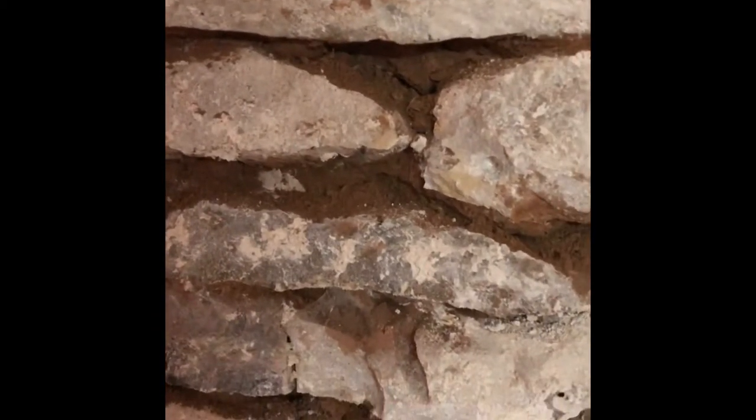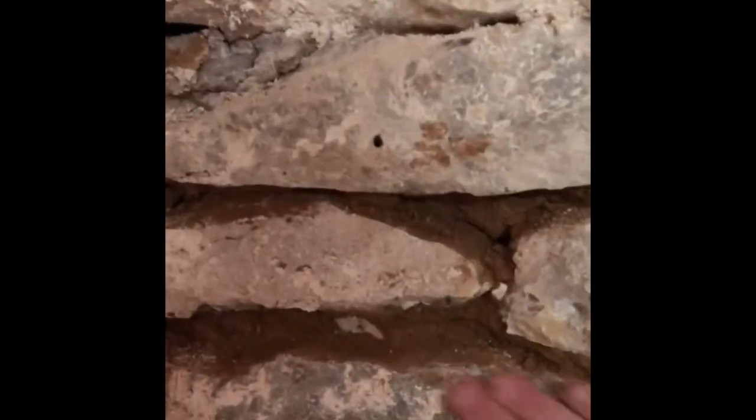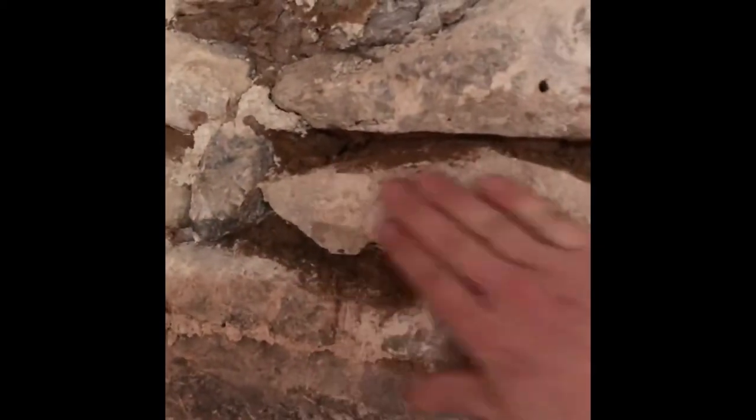That's the first step — get in there as deep as you can and get all the rubbish out. Then all you do is get a soft brush and brush off all the surface dirt, which will be mixed with the old dirt and chalk. Then use a wire brush to brush off all the old bits off the surface of the stone. Then we move on to the next step of getting ready to actually apply the new pointing.